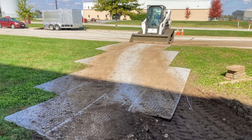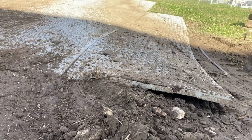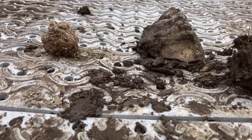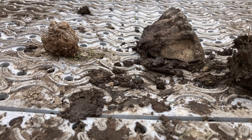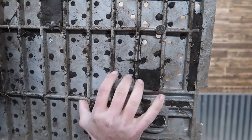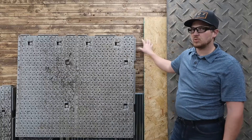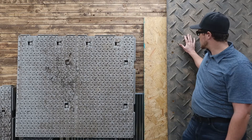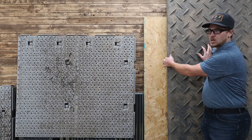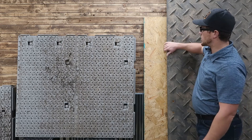The Workhorse mats are not as durable — you're not going to put them through as rough conditions. If you've got an air gap you're trying to bridge, much like plywood, these are not really suited for that. We actually had a big rock go through one when a piece of equipment pushed on it. I would say the Workhorse mats are more durable than plywood, but not quite as durable as the big Great Mat sheets. That makes sense — both are poly products, but the Great Mat is a solid poly product, which is why it's so much heavier.